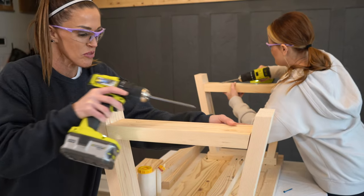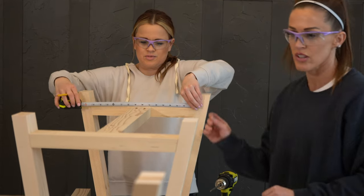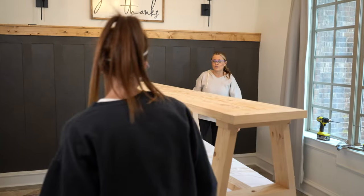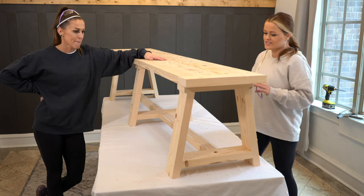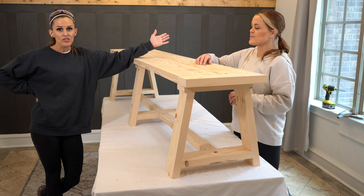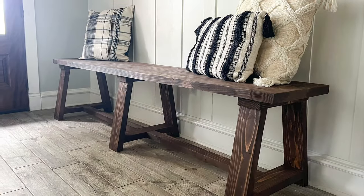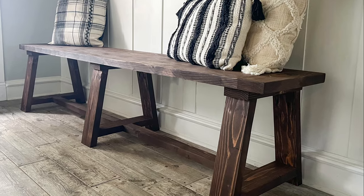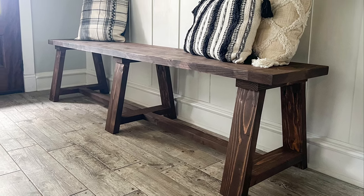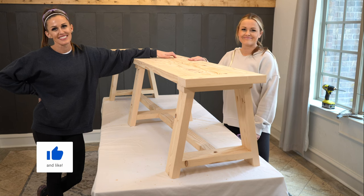We're attaching these with two and a half inch pocket hole screws. I love how this turned out — I love the lines on it. It's going to be so cute with that dining table. It looks like it was difficult to build, but it's actually so easy — a beginner could do it, and under $50. I sanded the bench really well and gave it one coat of stain, then finished it with a poly on top. I love how it turned out. This is supposed to be for a friend, but I like it so much I might just steal it myself and put it in my entryway. Be sure to subscribe — you do not want to miss another video.